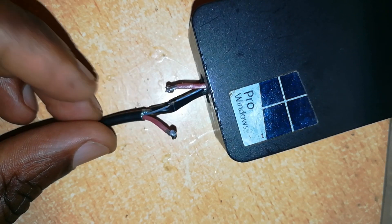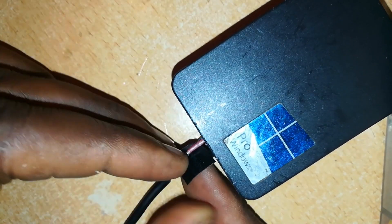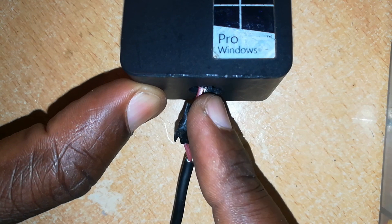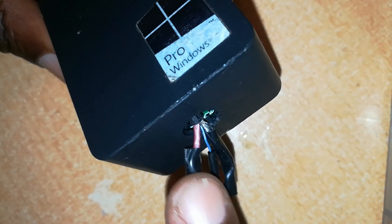The blue wire has also been soldered and it's sturdy enough — let's see from this other side; it appears to be strong enough. Insulate this too with a piece of tape, making sure it's covered. Here's the last wire soldered and now I'm insulating it. You can also use heat shrink tubing for this, but the caveat is that once shrunk, heat shrink tubing is not very flexible. Because we need to return everything back in there, it may cause trouble — heat shrink tubing might cause a problem going back through this hole, so insulating tape is better because it's flexible.